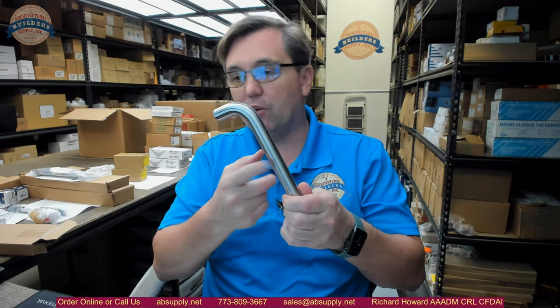Made of solid stainless — this is actual bar stainless in a brushed finish. A brushed finish over solid stainless is in fact the most durable of all finishes. That would be considered a natural finish. The most durable artificial finish would be satin chrome plating over a brass-based material. If you are using it in a coastal or high-moisture environment, try to order type 316 stainless; this would be typical 304 stainless.